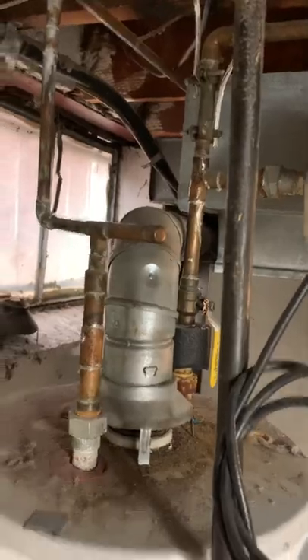Moving over to the first floor — a lot of modifications here. We want to get this piece off, put a patch here, and then recreate pretty much the same thing, because we want to grab all of the return. We'll probably go 30 by 25, come down, catch a 5-inch filter right in here, then furnace coil and supply. We'll end up stopping right where the slip and drive is, put a patch there, and recut into that.